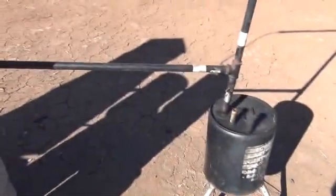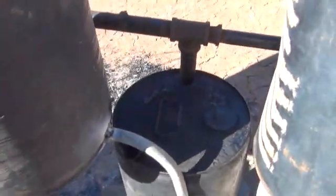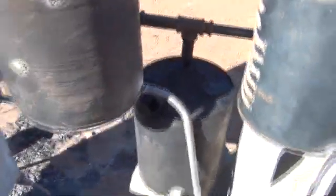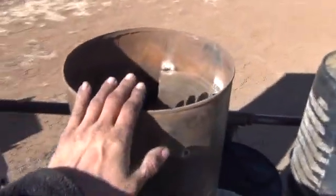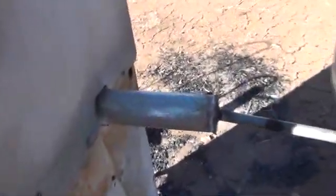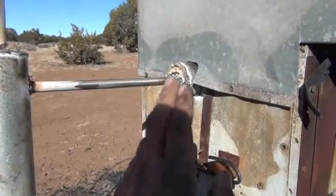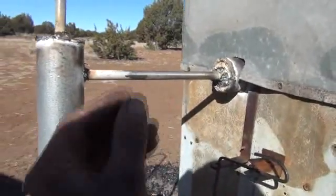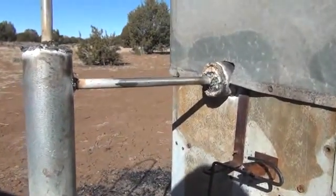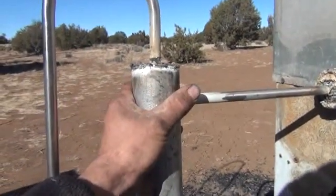We're through the fractional distillation center into our second catch. In the background you see our very first catch — that's the heaviest of the biocrudes, which we'll be running today. You can see a little pull-off spot at the bottom. Here's our biocrude feed into our thermal cracking unit inside of the wood stove. We have catalyst metals inside of our first reactor here, like aluminum oxide and others, all powdered down to powder form. We also have another base of catalyst metals inside our secondary catalyst reactor.